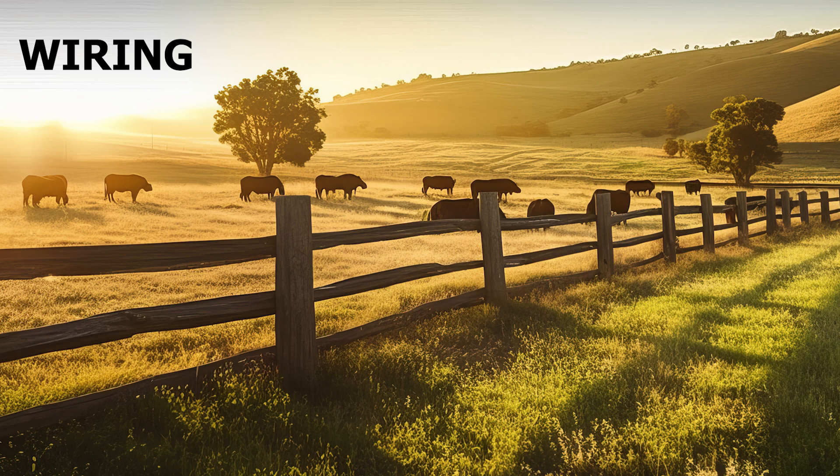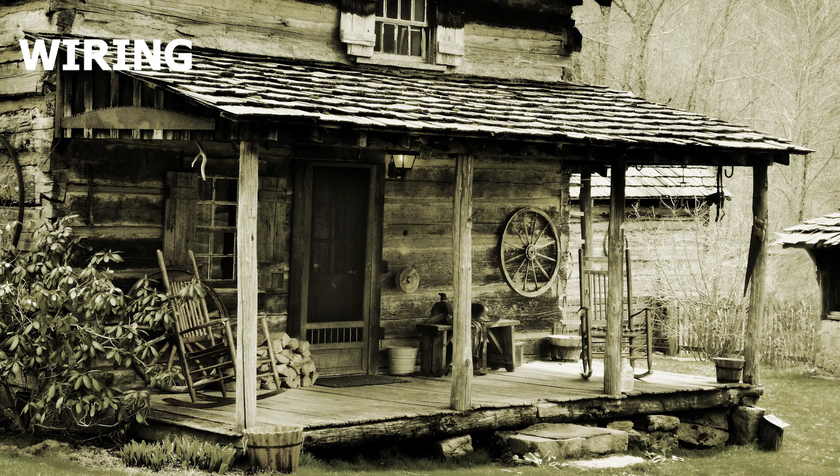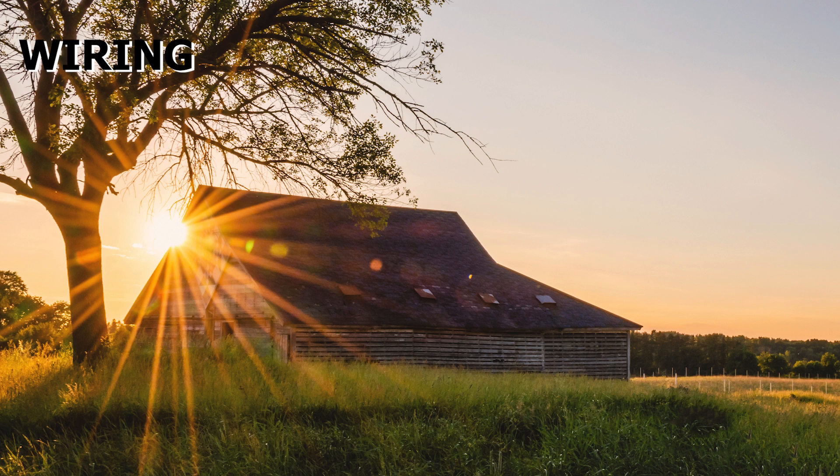Keep in mind that the node does not need to be installed at the valves. You can actually use 18 gauge wire to run it up to 100 feet away, so you could have it mounted or set somewhere that's more convenient — on your porch or in a shed or something like that. It is best to keep it out of the sun though for longevity's sake.